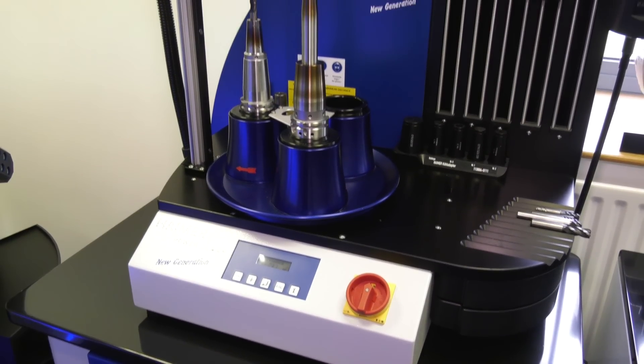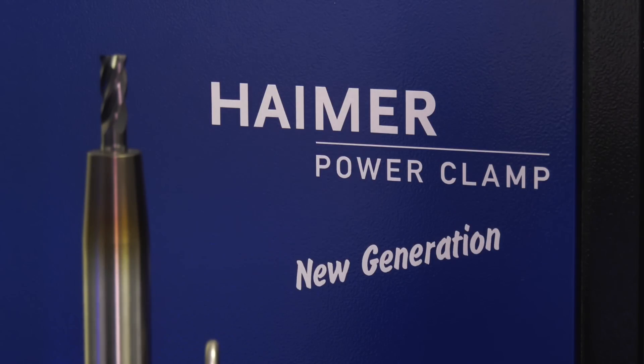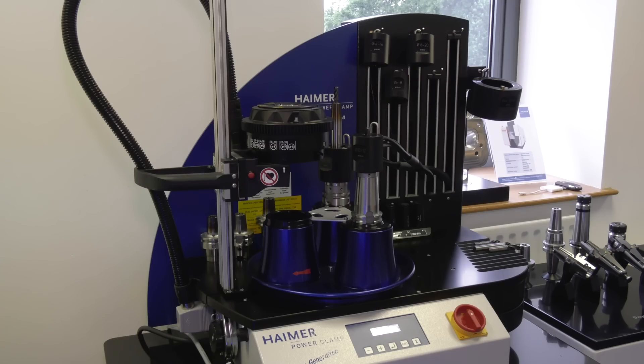Joe, who works on the MTD team as our tooling specialist, says this can be a far superior option to other methods. It is, because it's very accurate — we have a solid piece of steel, in most cases a one-piece geometry. We talk about three microns accuracy, and of course the same clamping force every time.